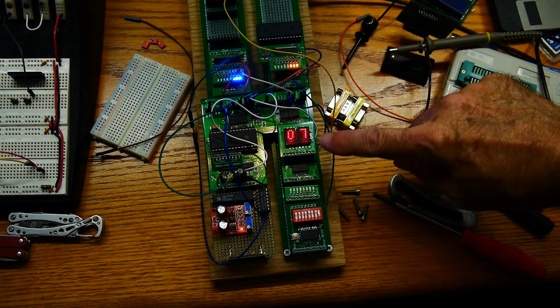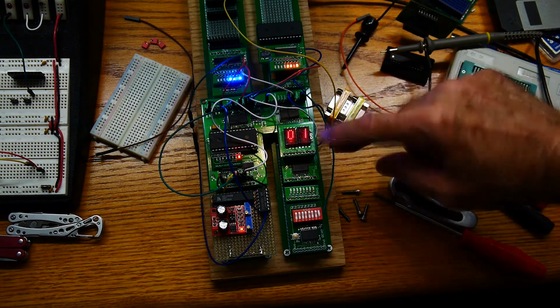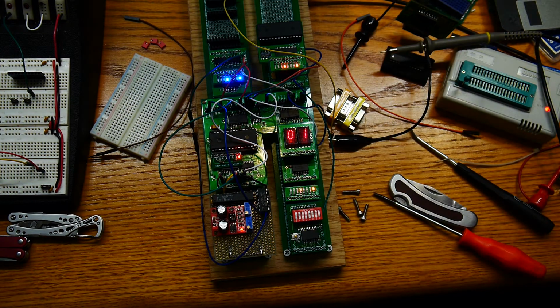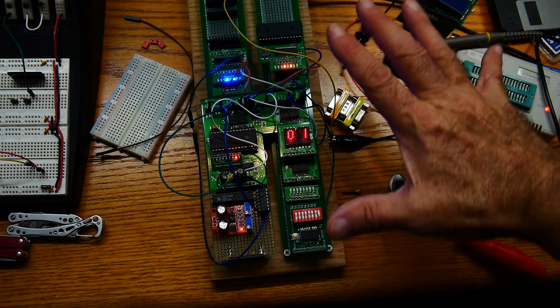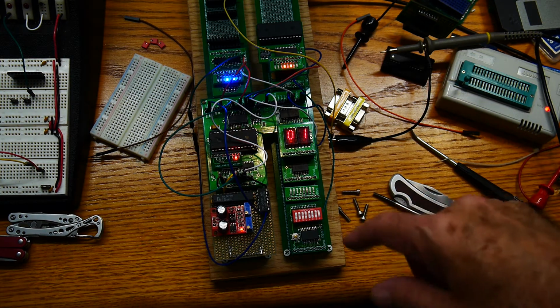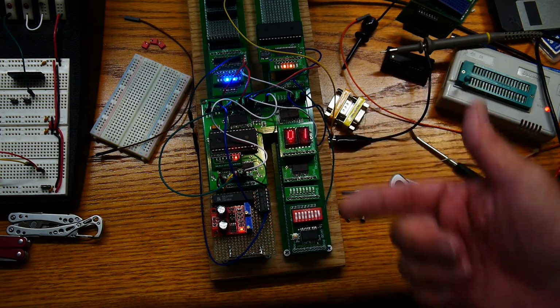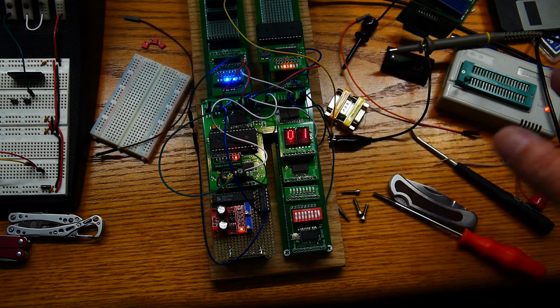It's going to count to 10, and then it'll do the 1 10 times, and then it'll load in the jump instruction, and the thing halts. So this is different than before. I noticed that my instruction 3 jump instruction was completely wrong. I had to rewrite it. I'll show you that in a second. I put that in, but it didn't help.